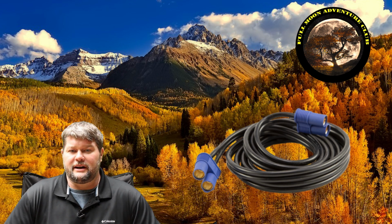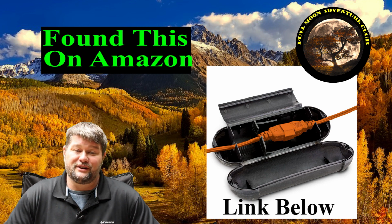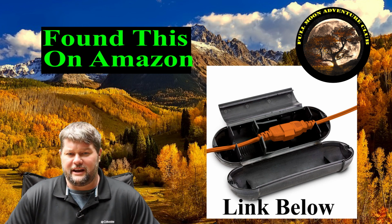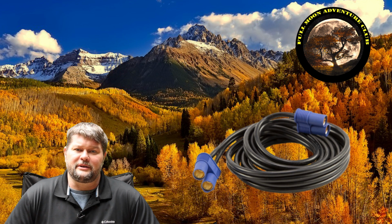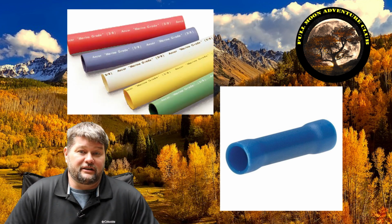But if you do want to do a permanent installation with these, I talked to Inergy, they said they're going to come up with some waterproof and UV cases that just clip on and take care of the problem. But also you can go to Home Depot and get those Christmas light waterproof connectors and put that over there, and they're actually waterproof and UV resistant for like $5, so that's not a really big deal. But if it were me, this isn't even an issue that was on my radar, to be honest with you, because if I was going to put this on top of the RV connected to solar panels or on a tiny home permanent style, I would go snip and use butt connectors and military, marine grade shrink wrap tubing. You're good. That takes 5 minutes and it costs $5 or $10.